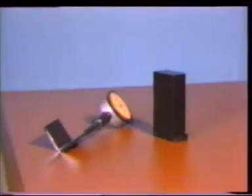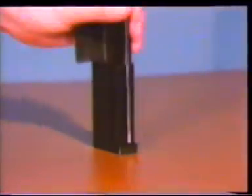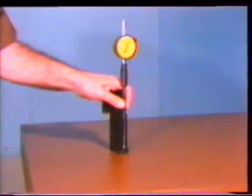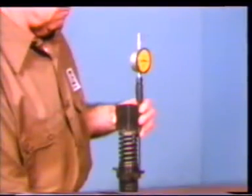The engine must be on top center for fuel timing. One special tool used for timing is the set gauge. It has a bottom step that lets you set a dial indicator to the dimension required for the unit injector. The dial indicator is installed in a fixture assembly and adjusted to service manual or fuel setting information specifications.